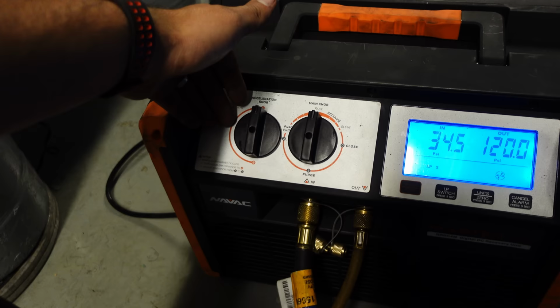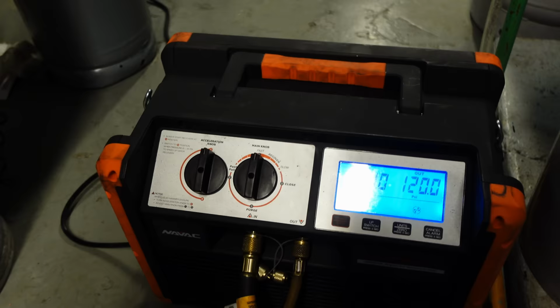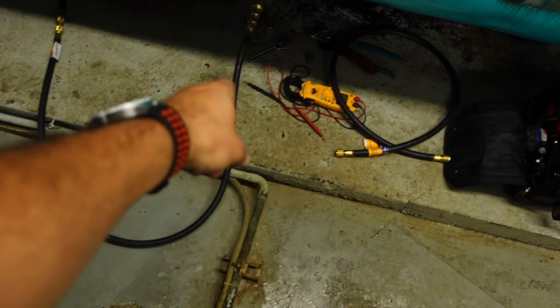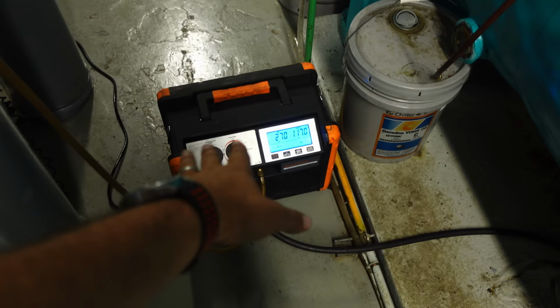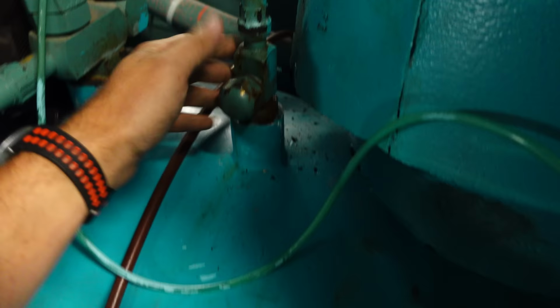So I'm going to reach out to Andrew Greaves, see what he has to say. I'll follow back up in either this video or in a video explaining that a little deeper, with their official response. So I promised you how we were going to do the push-pull setup. I'm going to hold to that. What we did, we came out of the drain port and fed into one of our tanks. When we came into that tank, we fed into the liquid port with a 3/8, and then out the vapor port, we came out with another 3/8 into the inlet port of the recovery machine. And out of this port, we fed a quarter inch into the quarter inch on this upside port, which is pushing vapor back into it.